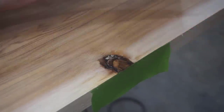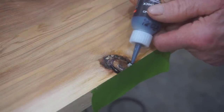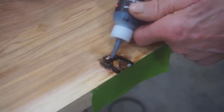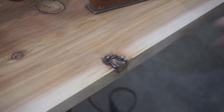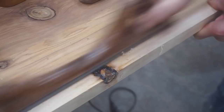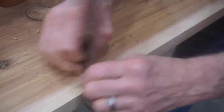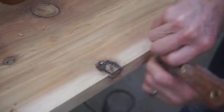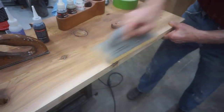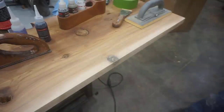There's a little bit of crumbling of the knot at the very edge. So I'm going to use a piece of masking tape followed by some thin CA, and follow that with some black to fill in the last of the voids and stabilize the repair. The thin serves to stabilize the knot itself and the thicker black will fill in the few remaining voids. Because this repair is a little on the thick side, I'll give it a few minutes to cure so it's hard when I scrape it smooth. I can use a flat metal file to shave down the repairs flush, then a sharpened putty knife, followed by 120 grit sandpaper so the finish of this repair matches the rest of the drawer front. Done.